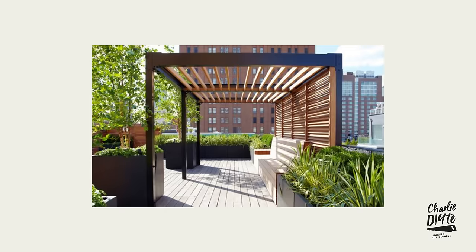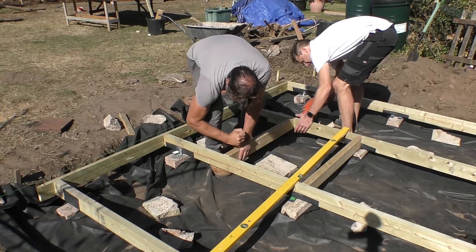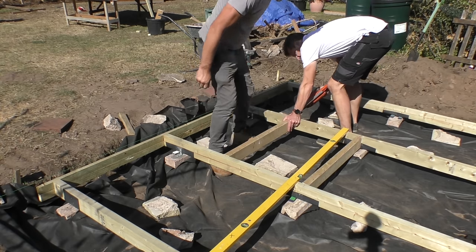To start using the decking as quickly as possible before the British summer breaks, I decided to incorporate pergola posts into the deck — the idea being to finish off the pergola later in the year modelled on a modern design. I've never made anything like this before, so I was indebted to my carpenter mate John who showed me the methodology for his foundations. To take the considerable weight of the hot tub I've scaled up to six by two joists.